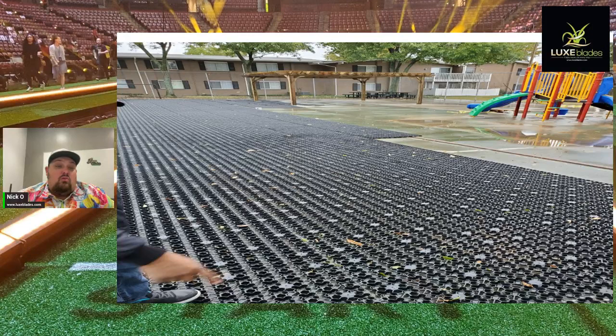But a really cool thing here, came a heavy rain, and as you can see, the concrete puddles, but nothing where the air drains at, because it sets an inch up off the concrete surface, or in this case, the old acrylic quartz. So if there's big gaps, we like to come in there with some self leveler, fill them in. But typically, your smaller gaps, what's really nice about the airfill, it saves money on labor because it bridges over those gaps. We can come in, lay this down, put the turf on top, say see you later.